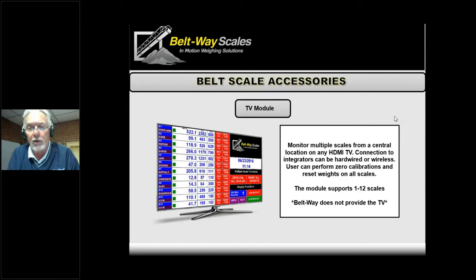Question: can you connect the indicator or integrator to a SQL server? Not directly from the integrator — the communications coming out of there are Modbus. If you have software that reads Modbus and saves it into a SQL database, that's possible. Alternatively, from the remote display there may be some customization options. With multiple scales, you can consolidate everything at the remote display and save it to a file, then load it into a database that way.